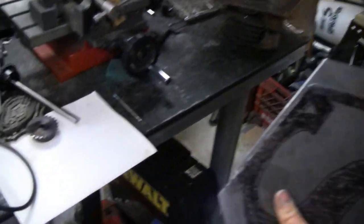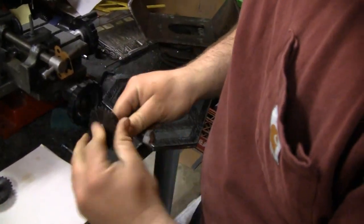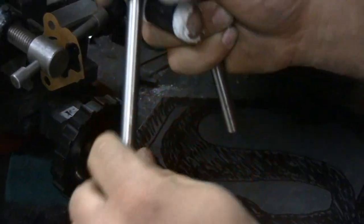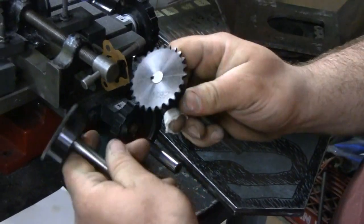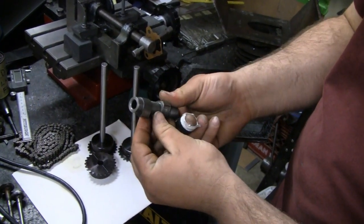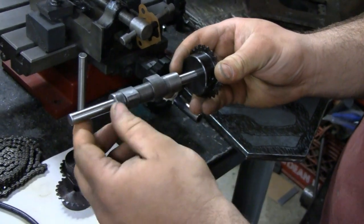We didn't show the guys what you do with the cam shafts here. Show them — we had to cut some keyways. I bought a broach set. These are going to be our cam sprockets. You can see I put the keyway in there on these two. And these rods here are going to be the shafts. I used the mill and I milled a keyway in there. It's a three thirty-seconds keyway, three-eighths shaft. The cams themselves — these are the original Briggs cams that we've cut down. They're going to sit on here and be pinned onto this shaft.